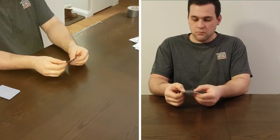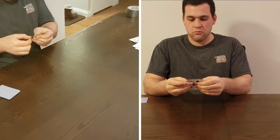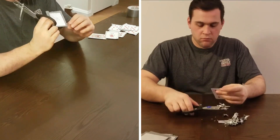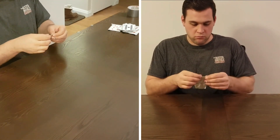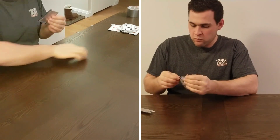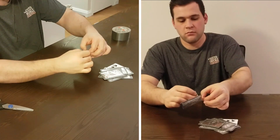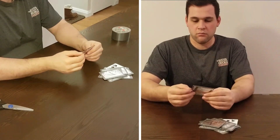Next, I'm going to attach my aluminum foil to my card using — you guessed it — duct tape. I'm going to go around the brim of the card with duct tape, and this is also going to help stop the battery from shorting itself out. When all the duct tape has been applied to the edge of the card, trim the excess duct tape off so the size of the card is not altered. For the double-sized piece of aluminum foil, wrap it around the card like so. Then take that last strip of copper mesh that you saved from earlier and attach it with duct tape, making sure that the copper strip is touching both sides of the card — because when you trim the duct tape, chances are you could have cut off the edge of that aluminum foil, so there are actually two separate pieces now.